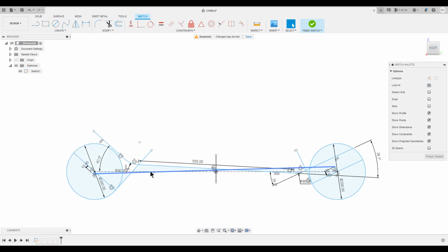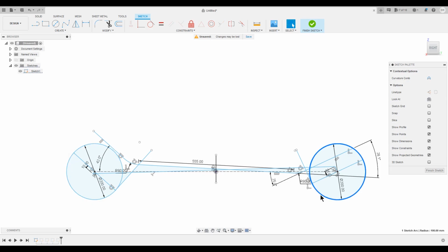Some of the other design things I'm considering is trying to keep the hanger as narrow as possible on the front, but going wider on the rear, and just allowing the rear to be a bit wider. I'm also thinking that a wider cam on the rear would be beneficial. I'm thinking like a 5-inch cam, and that's a big cam. The other thing is I want the deck lean to be a lot. I decided, at least for this stage, I'd rather get rail bite onto the dirt than run out of lean. So I'm going to design in a ton of lean into these trucks, and I will tone it back later as needed, but for now it's all going to be available to play around with.